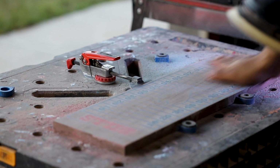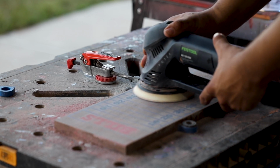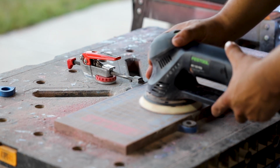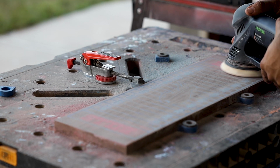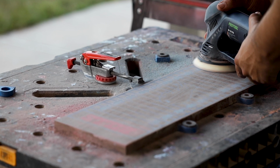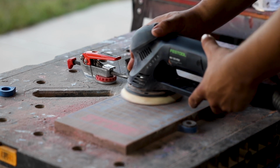The polishing side can be kind of weird. I did mention the technical way of sanding. You want to start out at 120, move up to 150, 180, then 220, and then 320. After 320, your surface begins to get kind of delicate, so you can set your keys on it and it'll scratch it up. 320, from what I've heard, is a good point to stop.